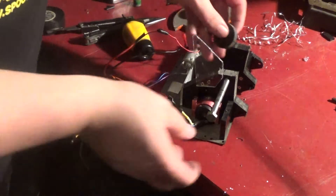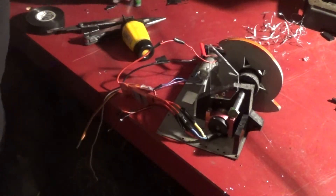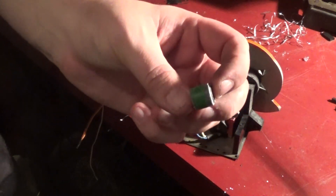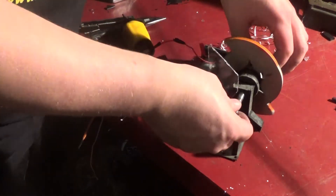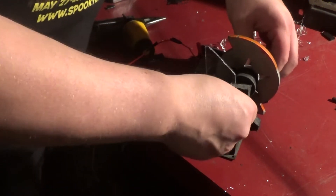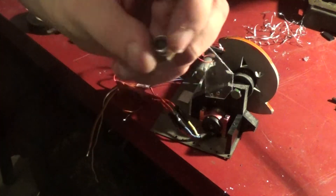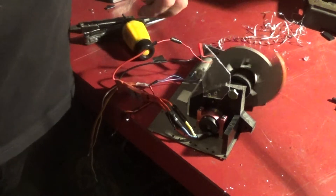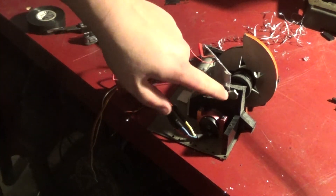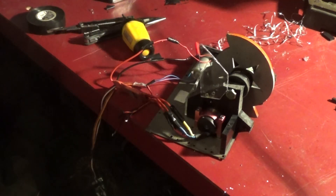Unfortunately, the way this is set up I have to kind of put it together in pieces. I have to put the shaft part way through, put on the spacer, then the belt loops up onto the motor, then it gets slid over the weapon, and then the shaft can go through the weapon. Right now the spacer I'm using is this little 3D printed ABS piece - it's not ideal, but so far it's actually worked decently well. One of the plus sides is that it fits in between the bolts coming out on the opposite side of the weapon assembly, so it kind of just helps hold things nicely together. On the opposite side of everything there's just another lock nut. Nothing's really ever torqued down because it's tough enough that it doesn't really spin, especially after I added this little self-locking bit - that actually keeps the bolt from spinning freely.